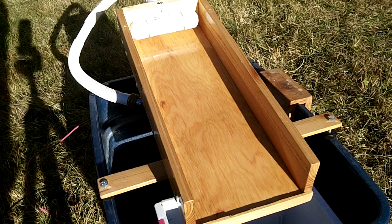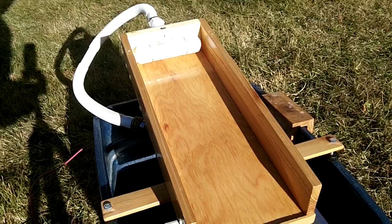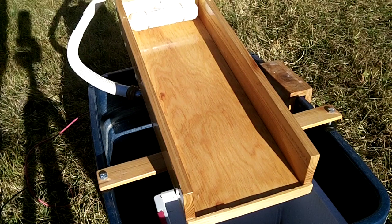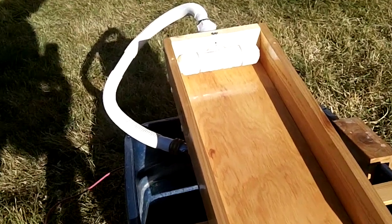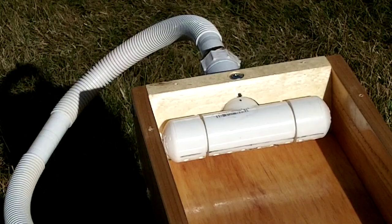It is six inches wide by 18 inches long, so it's small and portable, and I can run it out of this little 10-gallon tote here quite easily. And I found that it works very well. This is the basic sluice — it's got a half-inch plywood bottom on it. The two sides are made out of five-eighths inch cedar, just cedar fencing actually, and the back plate is made out of pine that holds the water bar on there. The whole thing is very, very simple.